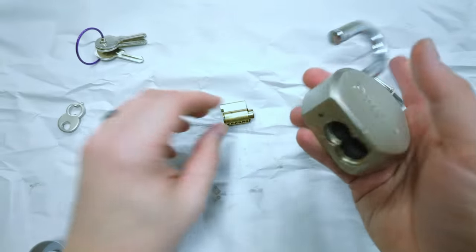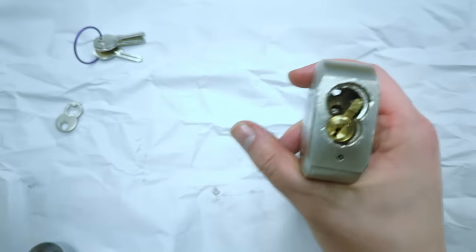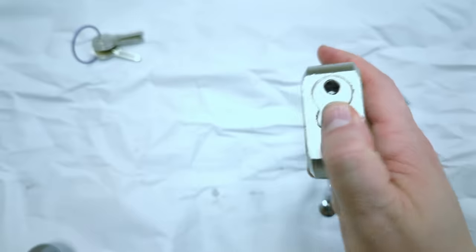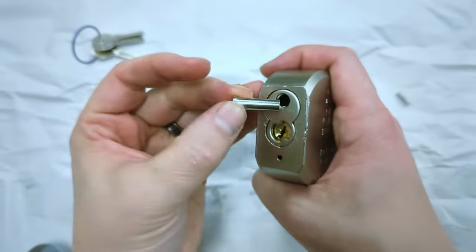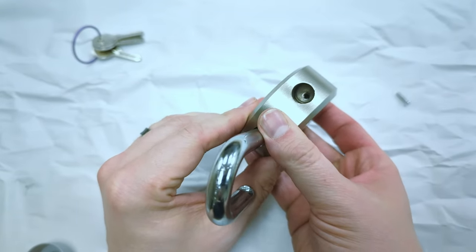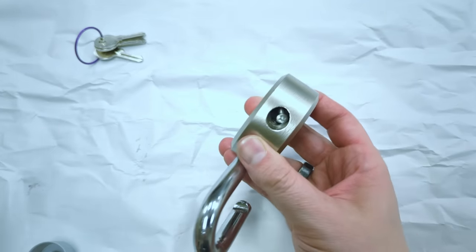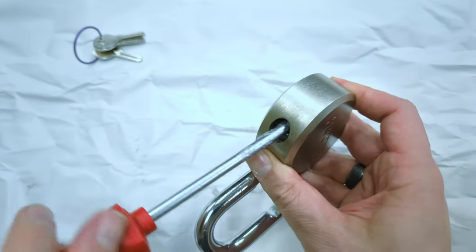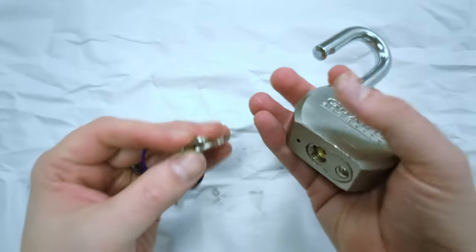Don't bang it around really hard when you're flipping it every which way. Let's just get our cylinder on there. Remember, we bias it over to the right side as you're looking in on the front. Get our new retaining plate in place. Now, of course, replacement plates — sometimes they're not a perfect fit. You need to knock them in a little more. Every tool's a hammer. A little nut stump on this end. And while we would love that hole to line up perfectly every time, it doesn't always. So you might have to fiddle around with it a little bit as you drop your screw in there. Give it some jiggles and wiggles and try to see if that'll land. And that feels pretty retained.